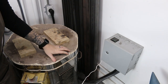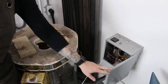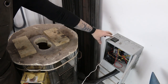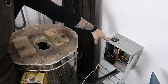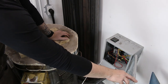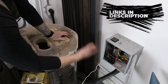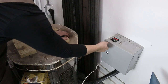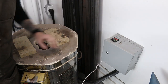Here's my old ceramic kiln I picked up for about 300 bucks on Facebook Marketplace, and then I built this controller — I made a video about it, I'll put a card up so you can check it out. This is a high-temperature version of the little PID-controlled ovens you see people use for home brewing, just with a lot more amperage. I have links down in the description to all the parts I used. I already set it to 1400 degrees, let's let it do its thing.